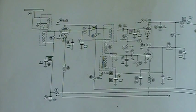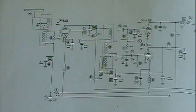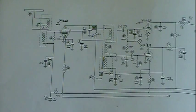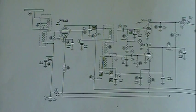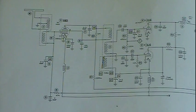So something better had to be made, and that's where the superheterodyne comes into play. The idea was that we build our amplification section for a radio or TV so that we are only amplifying one single frequency for our main amplification. We don't have to worry about different frequencies, going clear across the band. It only looks at one frequency, and we can tune it and fine-tune it and make it work the best at that one frequency so we have the maximum gain. That's your IF.